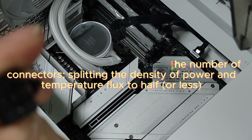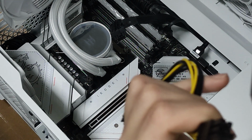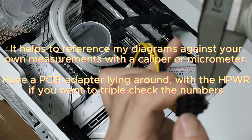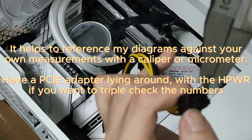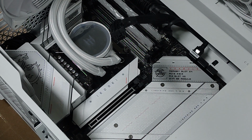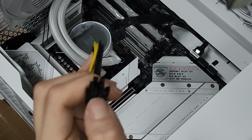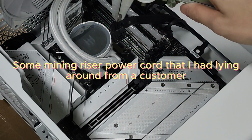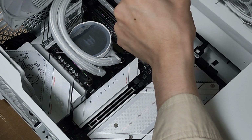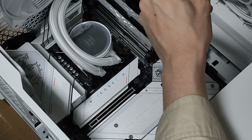You see these, if you look inside the actual connector itself, it's really hard to see, but you can see there's 2 dimples on the inside of that. And if you look at it just very roughly eyeballing, you see that the EPS 8 pin has about a, let's see, 0.6 mils. A 0.6 millimeter dimple on some really, really cheap design here. Now, this dimple here on this thing is 0.3 mils. Guys, 0.3 millimeters on the EPS 12 pin is absolutely a scandal that this is even allowed to exist without being declared a national fire hazard.